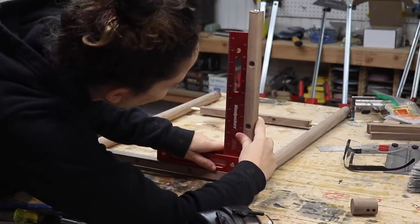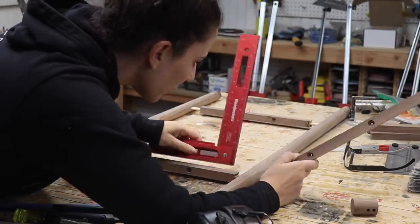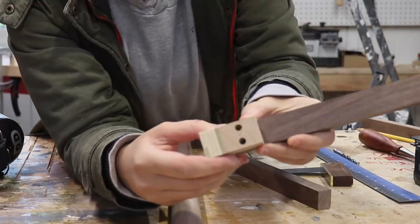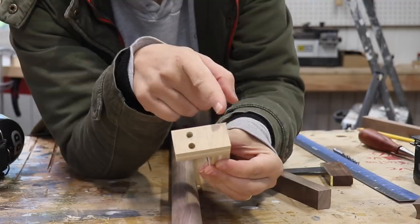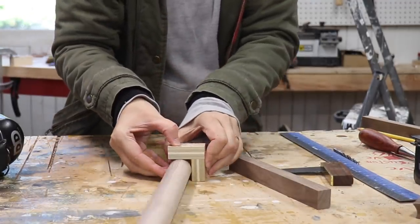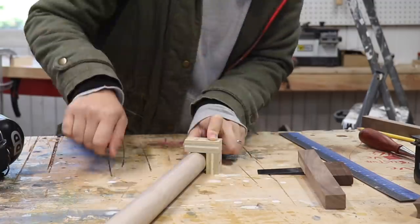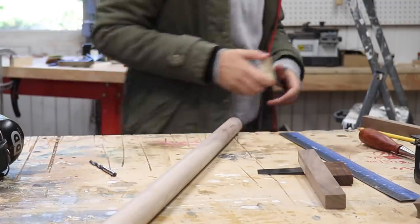This was really not a great idea - I was doing this late at night, just trying to rush to get this part finished. Which is really frustrating because that night while trying to fall asleep, I came up with a better idea. I should have made a jig of two pieces the same width as the stretchers - one piece as long as the dowel is wide, the other the same length plus the width of the plywood. After drilling two holes in the center of the jig, I could have lined it up on the dowel and used a brad point bit to make my marks for drilling. This jig would have been an easier and more accurate way to make sure these joints were perfectly 90 degrees to each other. Oh well.